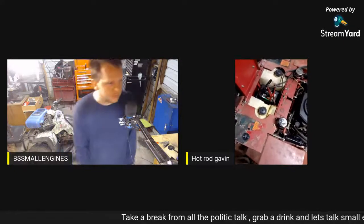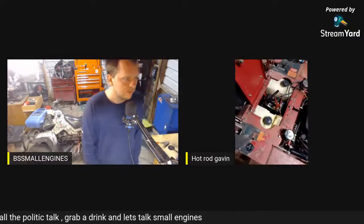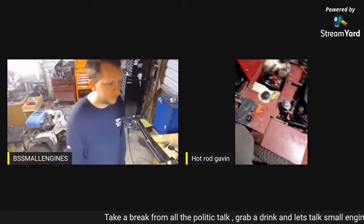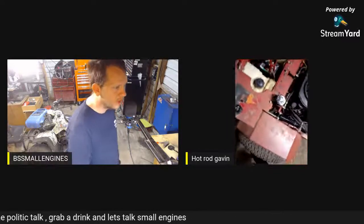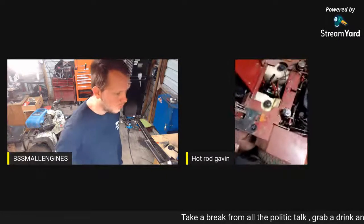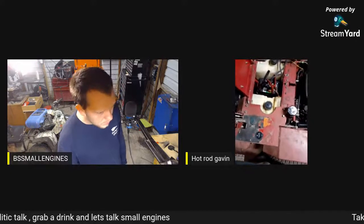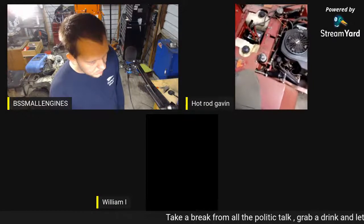Yeah, and it's like the other one. These are both 4-gallon gas tanks I figured out, and the one you can't fill all the way up or it leaks all over the floor because it has a small hole or something in the top. For some reason, the battery also keeps getting drained. The hour meter on this literally shows 10,000 hours. I think the hour meter's been running for a long time. Something's going on with the electricity for this though. Something's constantly on. It's not supposed to be.